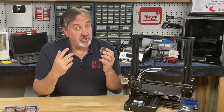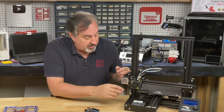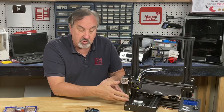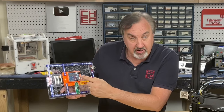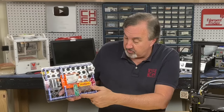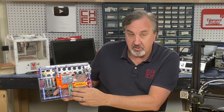The second function is a digital input. That's where the microcontroller senses the pins, whether they're high or low — to read a switch or a sensor. A good example is right here on a 3D printer: you have your stop switch. When the carriage moves and hits the switch, the microcontroller knows it's reached its home point and tells the motor to stop. I've got the same example here — a stop switch and a transistor driving a motor. The transistor is on an output pin, the switch is on an input pin. When I press the button, the motor spins; when I let go, the motor stops. It's monitoring the voltage on the switch and driving the output high to turn the transistor on and run the motor.